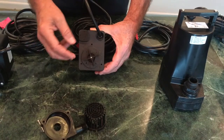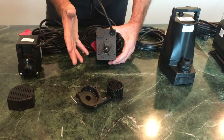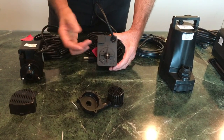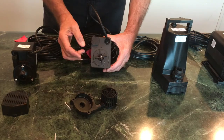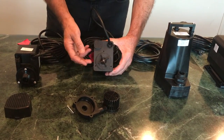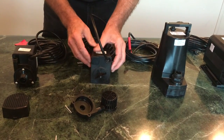These pumps have a lot of torque, so if you have a lot of calcium buildup — which would be from evaporating hard water — these pumps will generally just start to spin and that calcium is not likely gonna stop them from spinning, but you never know. If it's clean and you put it back together and the pump is still dead, then it probably needs replacement if it's under warranty.